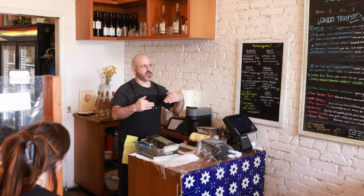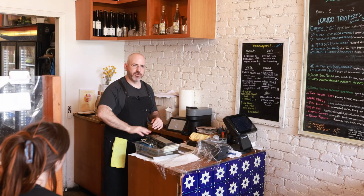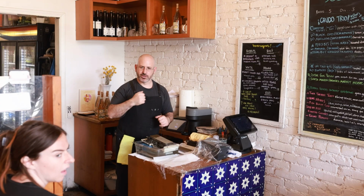Ceramic stones, the outsides tend to be harder than the inside, so those parts also wear a little bit more slowly. So by rounding it over, you can mitigate those parts sticking up a little bit further and causing weird scratch patterns on the blade. So flatten it, round over the edges, call it a day.